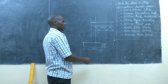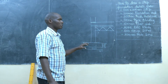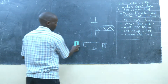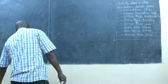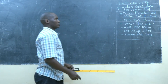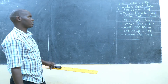So that is generally how a strip foundation looks like, just a sketch of it. We will now look at how we can draw that using instruments and the given scale to come up with the required strip foundation. The first thing we do is to measure the concrete strip we have been given, which is 200mm deep and 600mm wide.